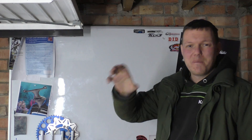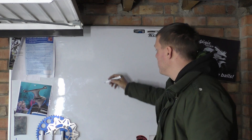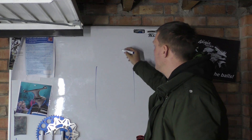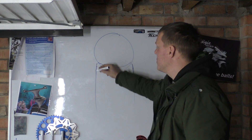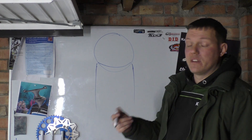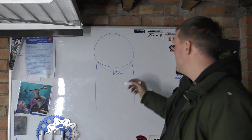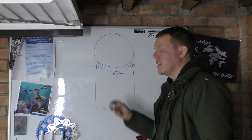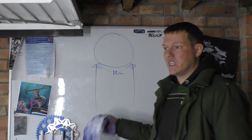You don't need valves, springs, retainers, valve guides, and so on. That's one reason — you can save weight. It also means you can have the valve timing defined by the profile of the opening of how these things work. The problem is, if you have this rotor like this, you're going to have to have a section that's blanked off for combustion, where you put your spark plug — maybe in the side, or maybe two plugs. You can get around that, but why isn't this being used?